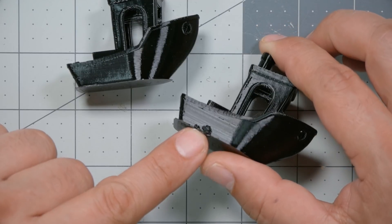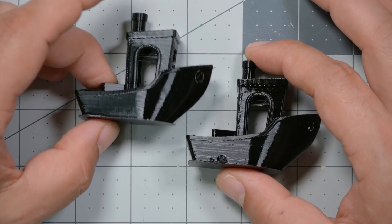There's a little defect here, but that's because the PTFE tube in my hot end was wearing out — not moisture-related. Regardless, there's almost no perceptible difference between these guys. The takeaway for me is that maybe it's not as important to dry my filament before printing, at least TPU, at least during winter when humidity is lower. I live in Knoxville and humidity is crazy during the summer, but I have air conditioning and my basement is pretty well temperature and humidity controlled. But especially for ABS and nylon, which are particularly bad for absorbing moisture, drying your filament before printing is a good idea.